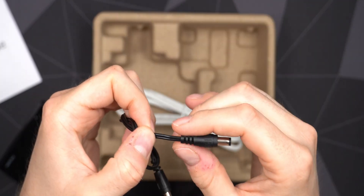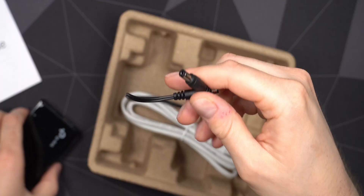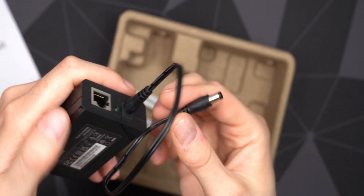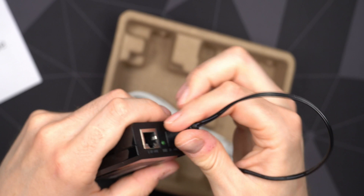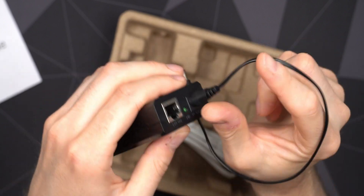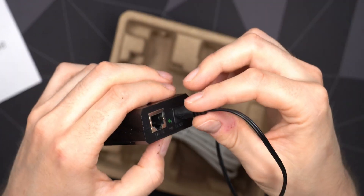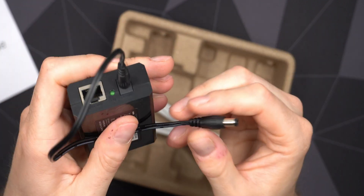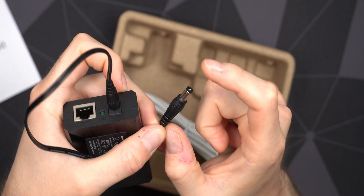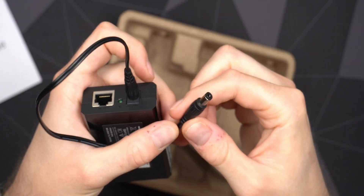I actually like this modular setup because you can get lots of adapters and cables on eBay, AliExpress, and so on, or you can make your own cable if you have some soldering skills. If your device uses a 5.5mm plug, you're good to go. Otherwise, you can get USB-A female adapters that fit into the 5.5mm plug, giving you a USB-A female output. You can also get small adapter plugs, though those tend to make the whole thing longer, which could be an issue if you're tight on space.